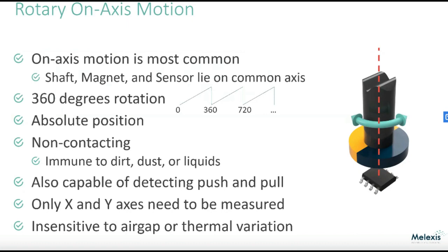So instead, what you could use is a magnetic potentiometer. You can see here on the right: it's a potentiometer knob, but it has a magnet on the end. As you twist it, the X and Y axes of the magnetometer chip underneath detect that rotation. You get full 360-degree rotation — the best of both rotary encoder and potentiometer — with absolute orientation detection. And unlike a potentiometer, there's no dead zone, no contact to worry about, no dirt, no liquids, no humidity. The magnet creates a field and the field is detected by the sensor on the chip.